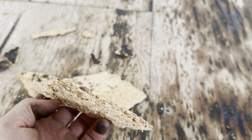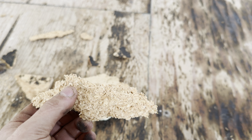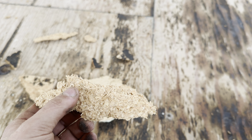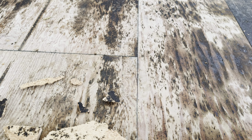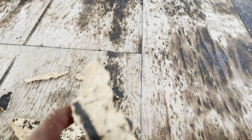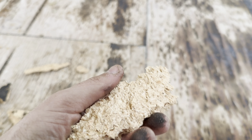You can see this is the particle board that was removed — it's just a bunch of small chips of wood and dust glued together. It doesn't have any structural strength, and when it gets wet it will actually balloon up. Plywood, which is what's down here, is multiple layers crisscrossed so that fasteners and glue will stick to it.